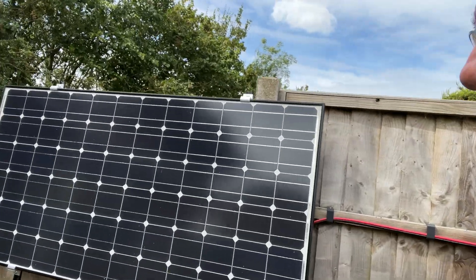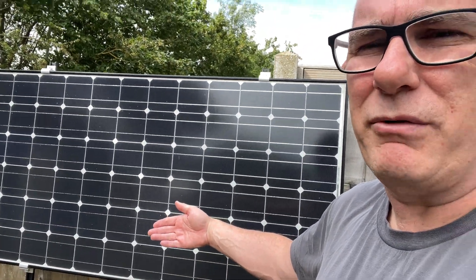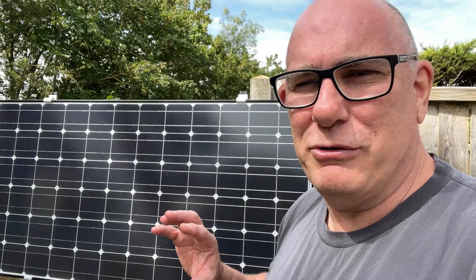Their orientation is almost vertical. If I head over to this panel here, underneath the panel you'll notice a little bracket there — that is tipping the panel up by about five degrees. That's not a huge amount and it doesn't really make that much difference, but it gives you a tiny little bit extra and we're all about capturing all the extra that we can. The ideal thing would be to have these out at about 35 to 40 degrees, but that would be blocking the flower bed below them, the flowers wouldn't get any sun, and my wife would get upset with me.